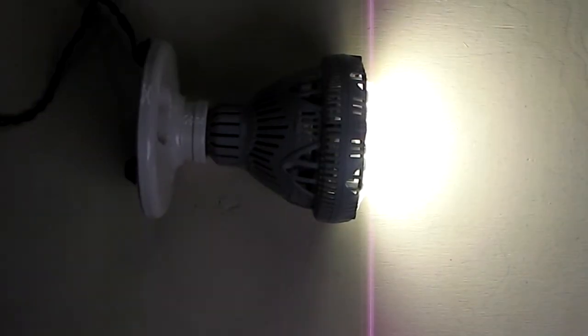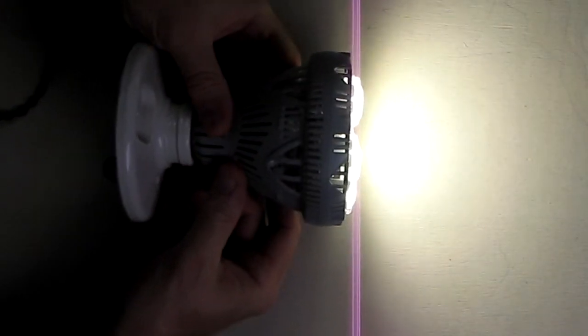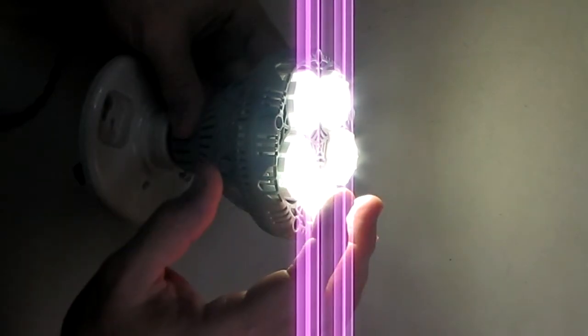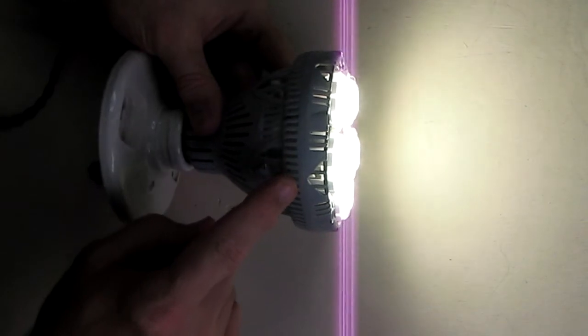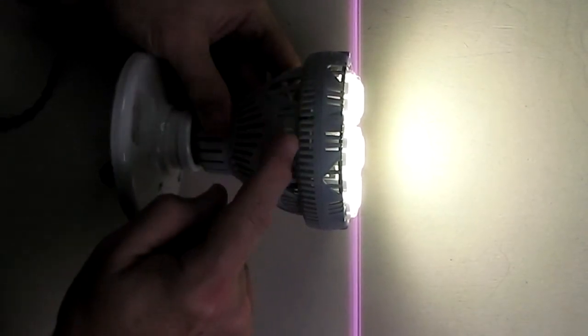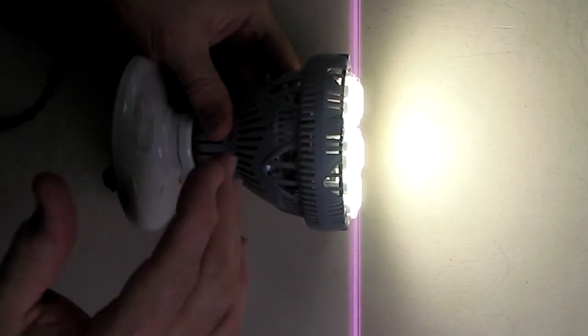So what this is doing is it's dissipating the heat in multiple ways. It's dissipating it out into the air that way. It's dissipating it using those ceramic pieces that I talked about. And those ceramic pieces have a large surface area because they're not just big blocks, they're actually shaped. And then it's also dissipating through these open ports where air is just flowing in there.